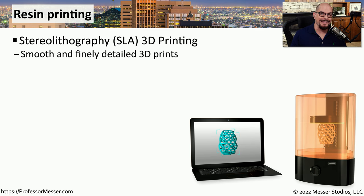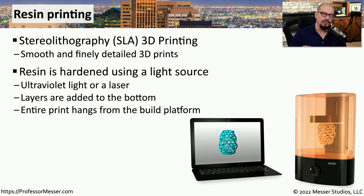Another type of 3D printing is a stereolithography printer, often referred to as a resin printer or SLA printer. This type can also create very fine 3D objects, and SLA printing tends to be smoother and more finely detailed than filament printers. This type of printing works in reverse to filament printing. There's liquid resin at the bottom of the printer, and the object being printed is attached to a build platform that moves up and down. The platform moves down into the liquid resin, where an ultraviolet light or laser hardens the resin to create a layer. The platform then moves up to remove excess resin, then back down, and the process repeats.